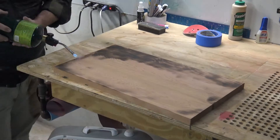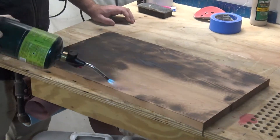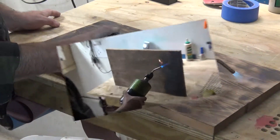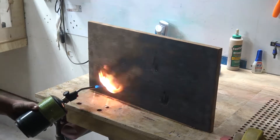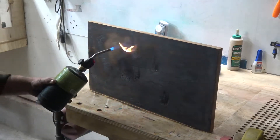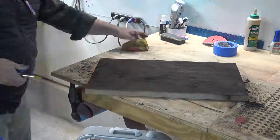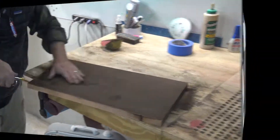Now that it's planed down to my desired thickness I'm going to use a torch and burn the top of the cedar. The torch is going to ride the softer parts of the wood - the meat of the wood, not the grain - and that way the grain will really shine through. I really want to get a dark burn on this. This is going to be outside and I'm not going to put a sealer over it; cedar will live outside really well. I'll give it a stiff hand sand and then let's move to the X-Carve.